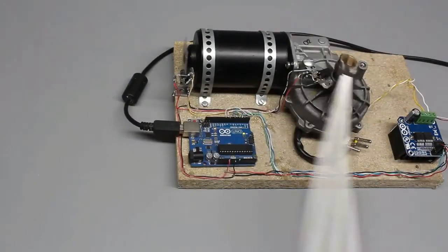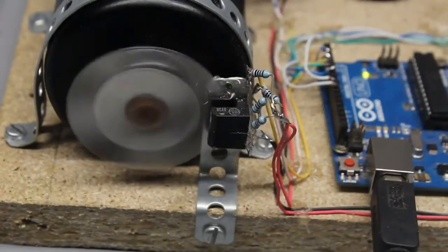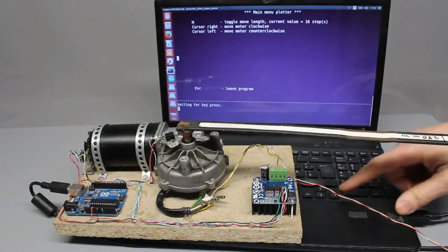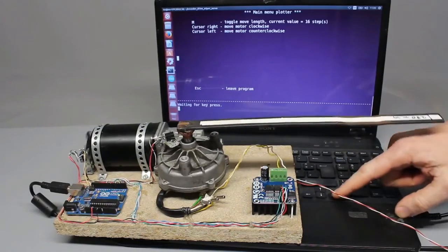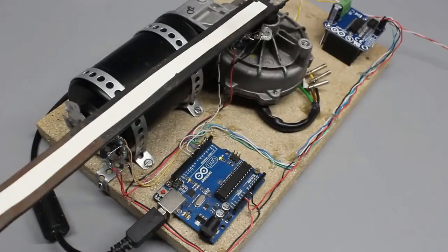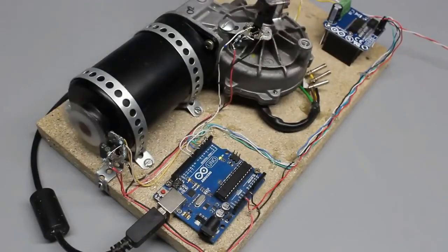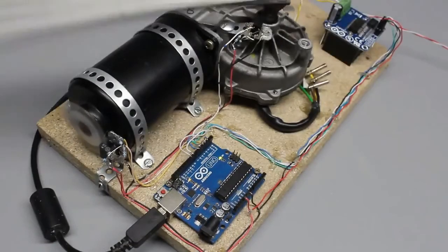You get a very powerful and precise digital servo. To get maximum speed and torque you have to adapt some software parameters of the control loop in the Arduino source code. Besides the proportional controller, a soft start function is implemented to avoid current peaks whenever the servo starts spinning. The setpoint of the servo is commanded through the USB interface, and the software on the host computer runs in a Linux terminal. That's all about rotational encoders for now. You can find the schematics and some machines using the drives shown in this video on the project page. Thanks for watching!